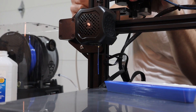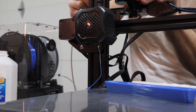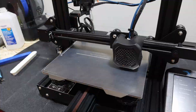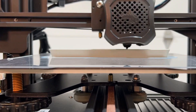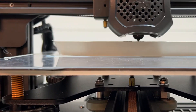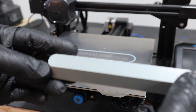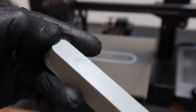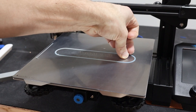How about we move on to a real test — this one is ASA. Normally it's printed in an enclosure but I'm printing it in my workshop in the winter time and we're around 18 degrees Celsius here. For this print we need a 110 degrees Celsius bed and the nozzle can be closer to the bed on this one for an average amount of squish. This print looks really good but it did release on one side before the print finished — not a complete fail but not perfection either. I know this isn't the way to print ASA. I will have to continue to test it in the coming weeks but based off what I've seen so far I don't think it's going to be a problem printing with it.